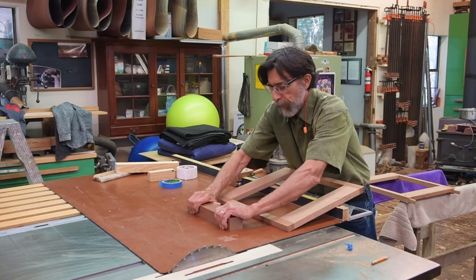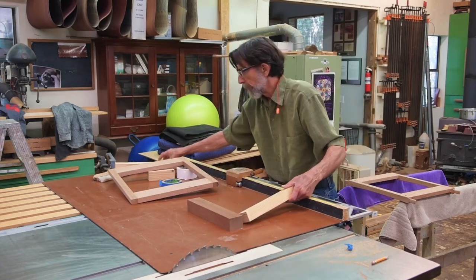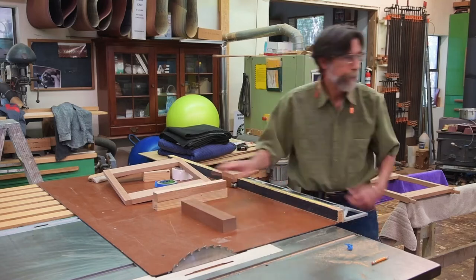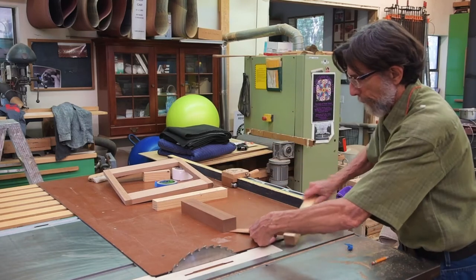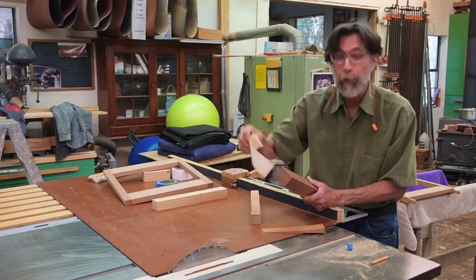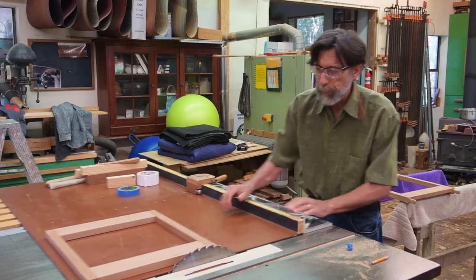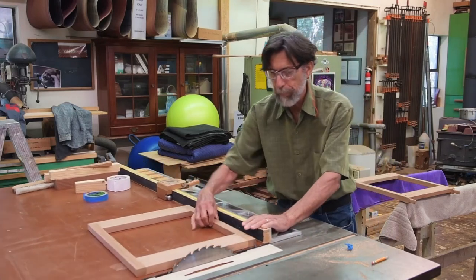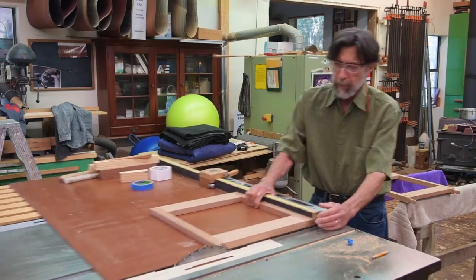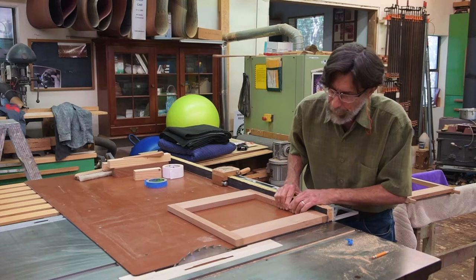Now we're done with this double stick tape. This stuff is remarkably resilient, as you'll see here. Yeah, it's not budging. I'll get a wedge and drive it in there. If you ever need to hold anything down, try a little double stick tape. We're going to do our trim cut. Let's lower the blade. A lot of blade showing. And we're just going to skim this side. Make a little bitty cut.